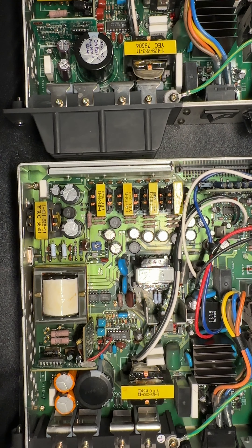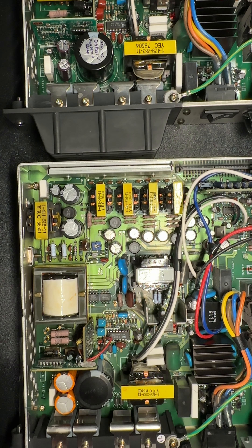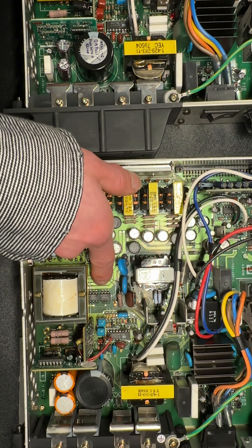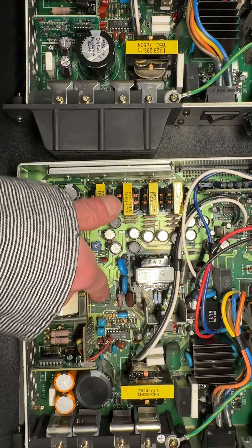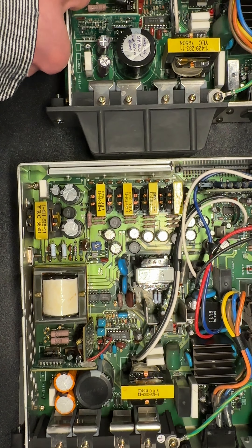Part of the reason I'm talking about this is that sometimes you can backport improvements. For example, if you were recapping the mains filter on an A board, you could go for a 270µF. On my BVM-2011P, the G board between revisions had 270 at 200 volts as a pair, and on the later revision the same farads but at 250 volts each — so I backported that when I recapped it.